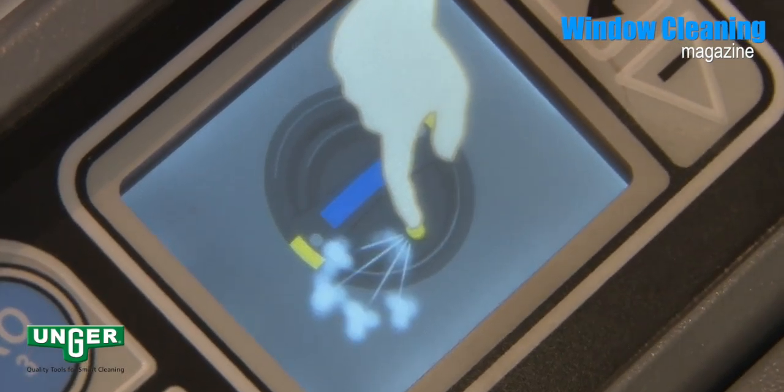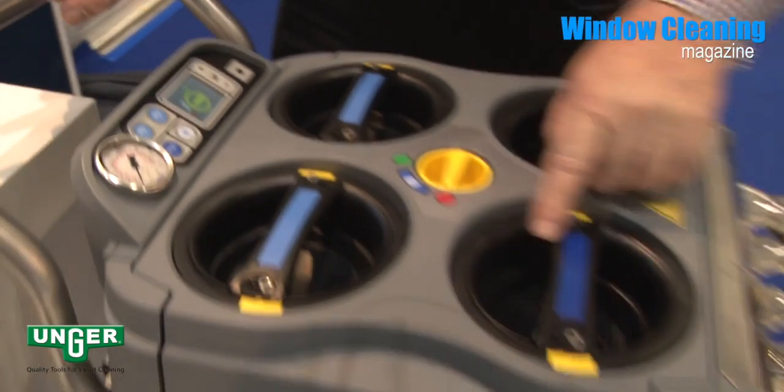I know it's rotating. All right, so in here, inside the top of the carbon in the DI, there's a little yellow button, and it's used for two purposes. One, after reinstallation, there's air that could be trapped at the top of the container. So occasionally, from time to time, you'll push the button to release the air out. And two, since the unit operates under pressure, when you do want to change the filter, you'll want to release the pressure before you open the top of it so that it doesn't put any water all over the place.